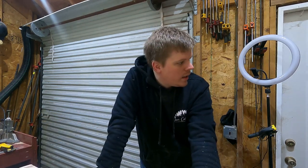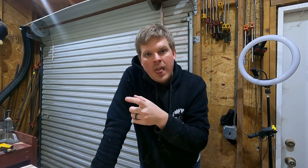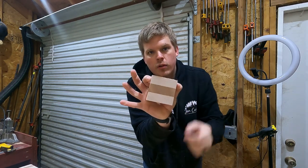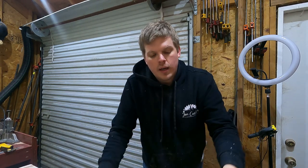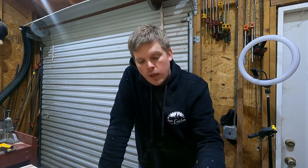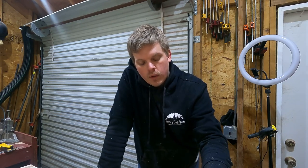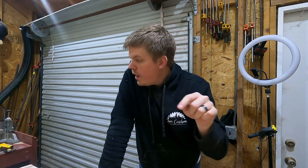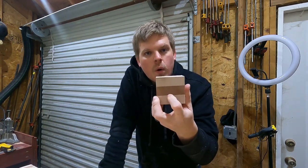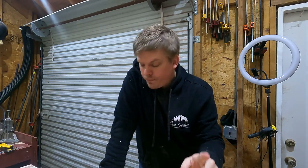what I'm short on is I took a large slab of maple, cut two strips 3.5 inches wide, 60 inches long, and then did the same thing with the sapele. Saw those up to size, and then milled them down to final thickness. I wanted each one of these at 1 inch a piece. From that point on, it looks like I do have footage.